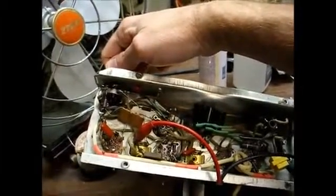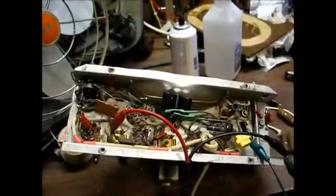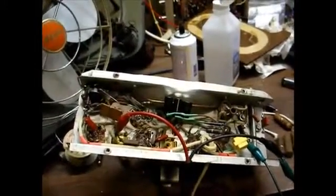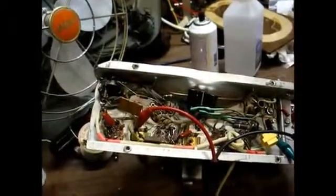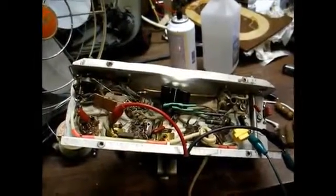Sounds like a thunderstorm. What happens is the internal mica capacitors inside of the IF transformers become leaky and thus cause voltage to leak from the primary winding over to the secondary winding. And when you check your voltage on the secondary winding, you find that it's a very high positive voltage usually. Well, it can be from a few volts to 10 or 20 volts. And looking at it on the oscilloscope, that's a visual representation of the garbage that's coming out of that second IF transformer.